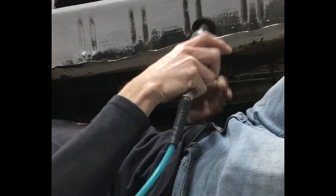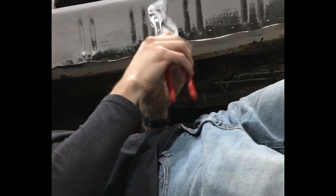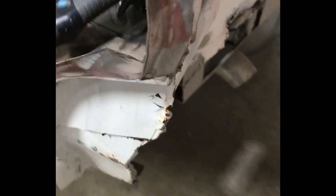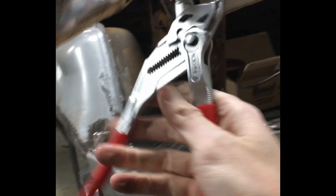Getting this lower flange out of here — the remainder of the bottom of that quarter panel. I'm kind of going to bend it down, get it out of the way. We're also getting the rest of these parts here out of the way too. Now we've got a little more clearance there. This comes off too — we'll cut this away, and that gets cut away. The remainder of this part of the flange here, and then we can get that quarter on.